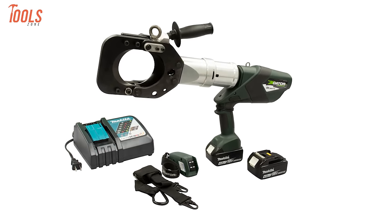The Ground Rod Dog XL from iTool Co. makes quick and easy work of driving large ¾ or 1-inch ground rods. By attaching this innovative accessory to a standard hex-shank jackhammer, electricians can safely install ground rods from ground level instead of dangerously climbing ladders and swinging heavy sledgehammers. The Rod Dog XL's smart design grabs and holds the rod, enabling you to effortlessly drive it into the earth with a simple squeeze of the jackhammer trigger. Once the rod reaches the right depth, use the end receiver to smoothly finish it off flush to grade.